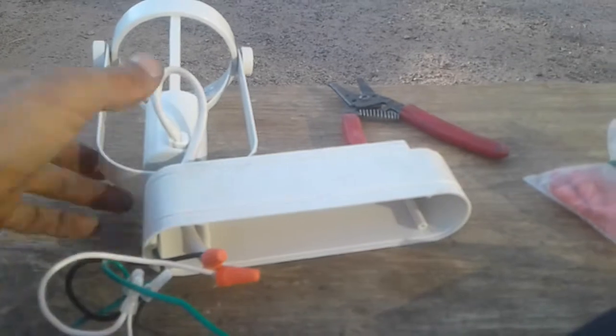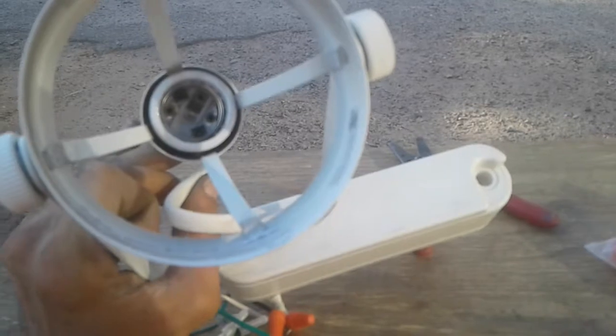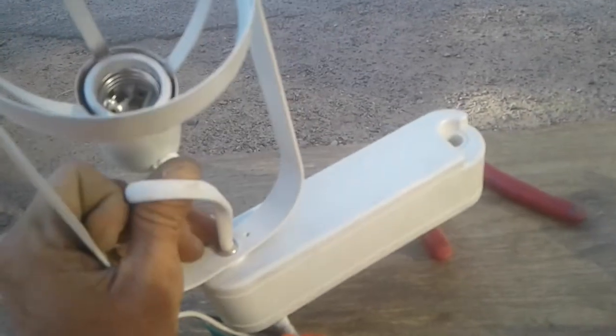I mean, you can see this is a standard light bulb socket. So why wouldn't it work? Well, if you look inside here, my camera is horrible. It says caution, risk of fire. Use only CDM par 30L type metal halide lamp, 39 watt M130 or 70 watt M98 M139.